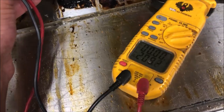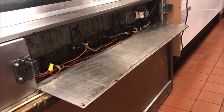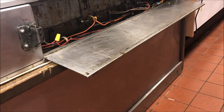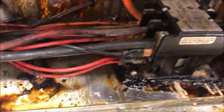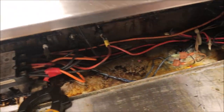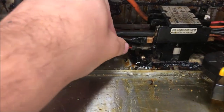Let's check for power - we do have 208 in - and as soon as we turn on our power, you can hear something squealing down there, so we obviously have power. The breaker did not trip, which is really good news. We've isolated about half the circuit, which has made our troubleshooting much easier. I disconnected that fan just to see if that's what was shorting - I don't think it'll pop a breaker - and we have 208 volts but let's fire up: we have zero volts. Still dead shorting, so it was not that blower motor.